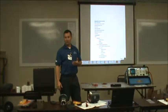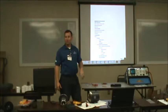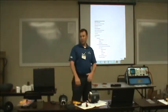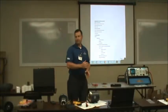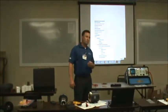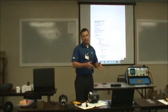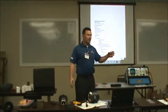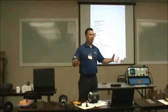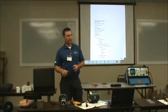You can help your efficiency in your plant too. If you design your wet well to hold control, a higher wet well, it puts more head on the pump, right, and pumps more for you at less hertz. So you have to be careful. Just because you pull a pump out of this station over here, it doesn't mean it's going to work over here. Sometimes we have to. That's understanding.